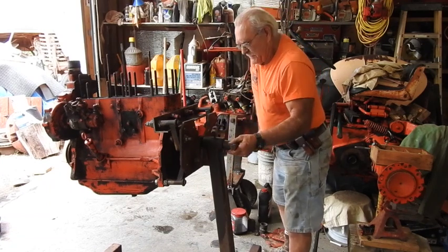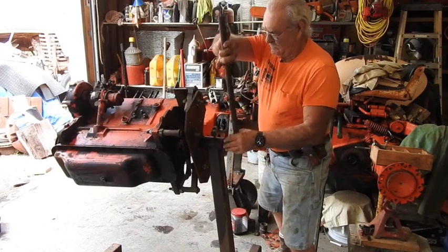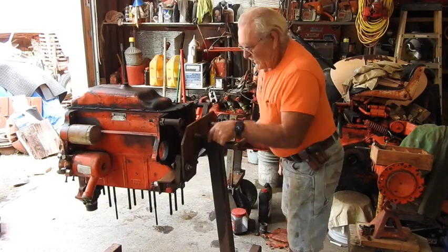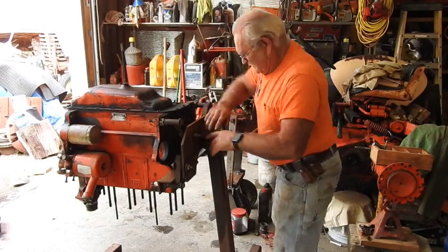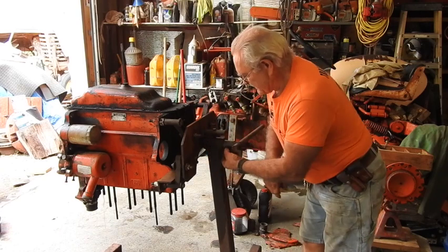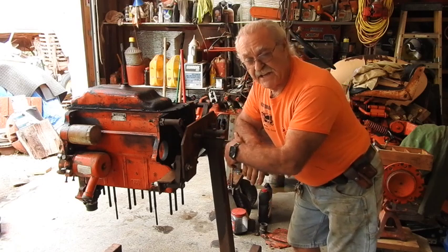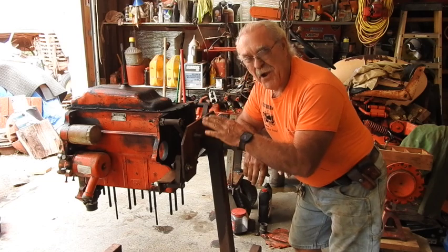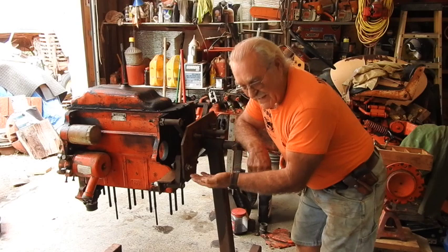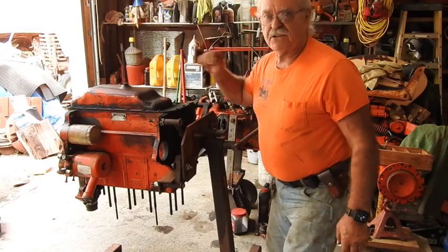Next step we're going to rotate this thing upside down and take the pan off. I've got my set screw loosened up here. Sometimes whenever you're working on it, if you don't have set screws in that shaft — and this is an inch-and-a-half solid steel shaft — if you don't set that set screw into those indentions you drilled into it, you could be working on it at a 45-degree angle and all of a sudden it'll flip on you. So you always got to make sure you lock those. We're going to go ahead and grab the impact and drop these guys off of here.